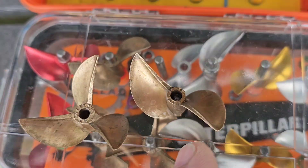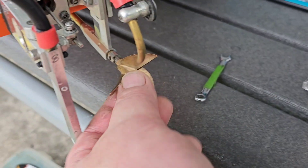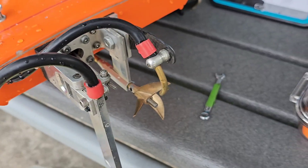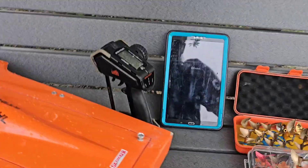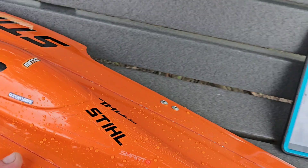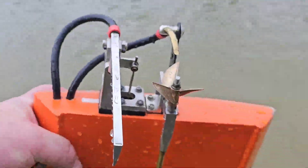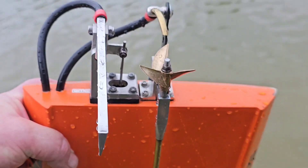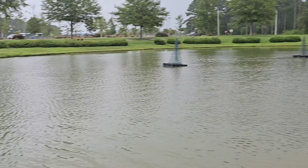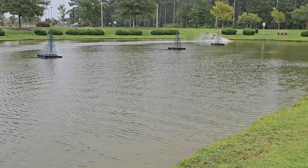We're going to run this three-blade 1916-1917 — reduced blade area and it has more rake, so I'm really excited to try this on here. Got the three-blade on. Getting 66 — I feel raindrops, so I apologize if the screen becomes blurry. Making sure it's not going to hit my water pickup or my rudder. Going to do a couple laps with it, but I don't think it'll take more than that, temperature wise. It's raining — like a mist. I hope the camera lens is okay.